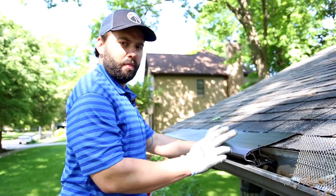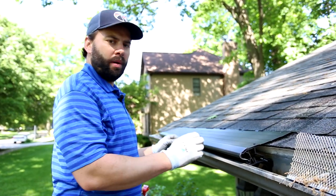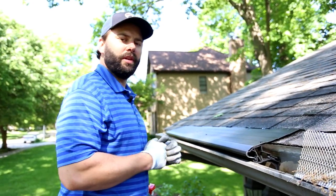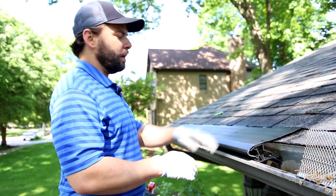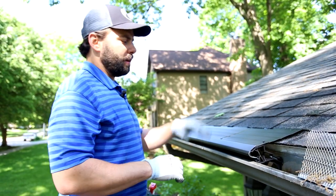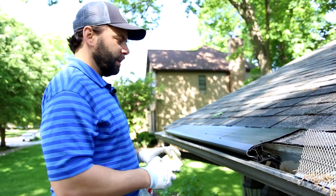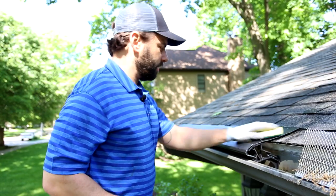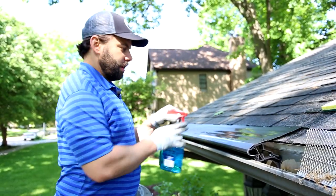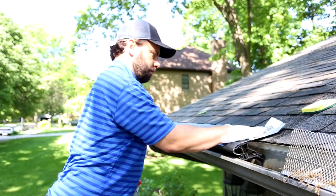With the TruGuard panel, keep in mind that any roll-form steel or aluminum product is going to have some residual vanishing oil on the top of the metal. Vanishing oil gives the metal the ability to move through the roll formers smoothly, and there will always be a little bit of residual oil on top of each panel. There are two options: in about 30 days this will completely cure, or as you're installing the product, you can take a scouring brush, give one quick pass on top, then give a couple quick sprays of Windex and wipe it down.